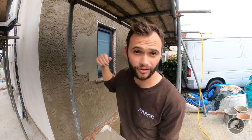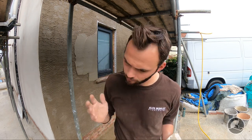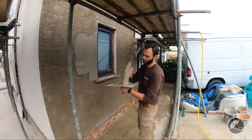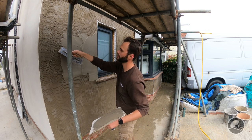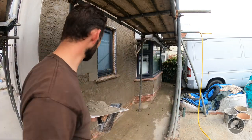You'll notice there are a lot of stones in the sand. Early in the series we were using a different brand — unfortunately this supplier has had some terrible sand out of a particular branch this season, so we had to switch. The downside is there are quite a few stones in this sand so you might see a few drag marks. Always, where possible, buy the best quality sand you can. Also — you don't want to overload your hawk, certainly if you're doing this on your own.